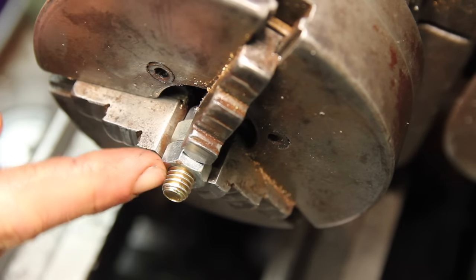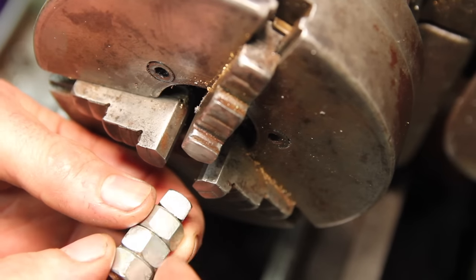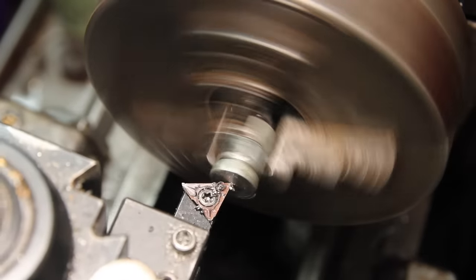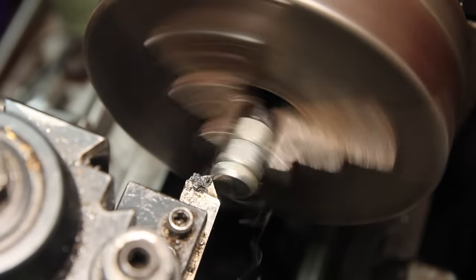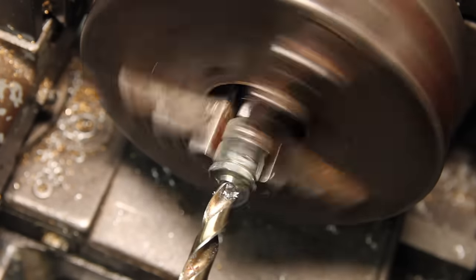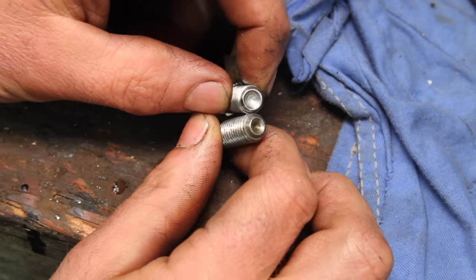Now if I just machine like that, it's going to spin that bolt back out. Do a little sacrificial jam nut on there. That back one can still free float and align with the front one there. Give that a quick shot on the wire wheel to take the rest of the yellow plating off, and I'd say that's a pretty good facsimile of a cup point set screw.